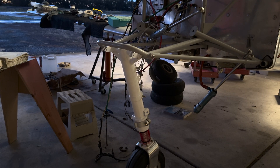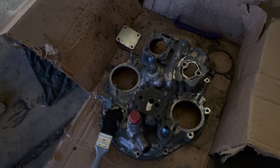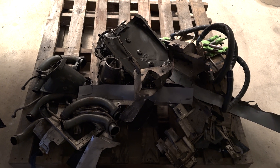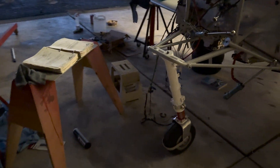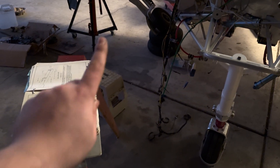These are brand new drag links — here's the old one, here's the new one. Once this goes on, it hooks right onto this gear to make sure it's going where it needs to. It's getting a little late so I'm probably going to call it a day. Once we get our part in, probably tomorrow or the day after I'll come in and work on the accessory case for the crank — we stripped it as much as we could. There's also the propeller governor somewhere; I finished stripping that and I'm going to paint it. We might also paint the oil pan and a few exhaust and intake pieces. It would have been nice to start on the gear work today, but this is just how it goes in aviation — sometimes you're missing that one essential part even though you have all 500 others.